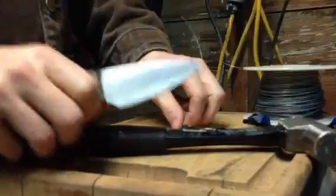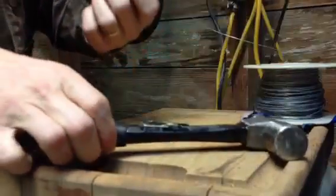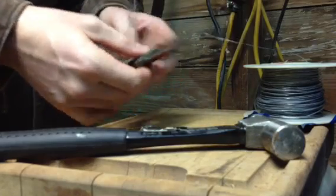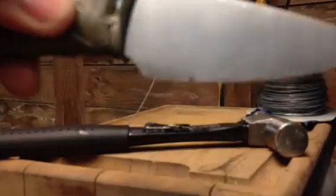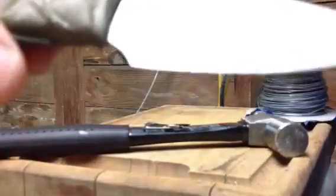No chip, but I do have a roll. That is on a four-thousandths edge, and I expected some damage. You can see the roll there, but that's not a catastrophe. It's something I'll take out real easily without having to do a whole lot of extra work to the knife.